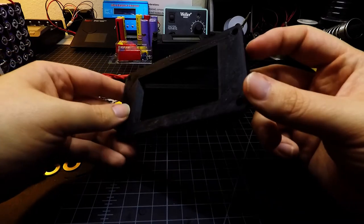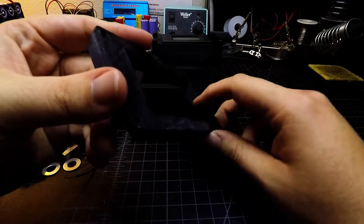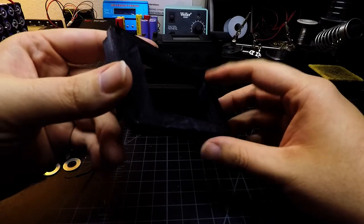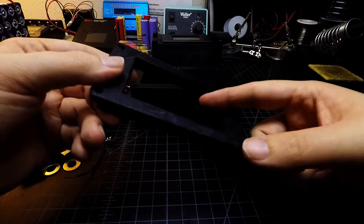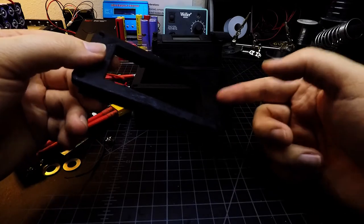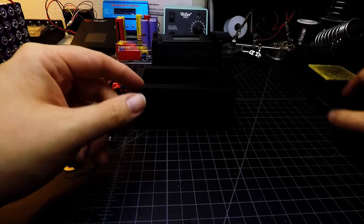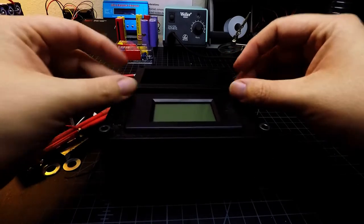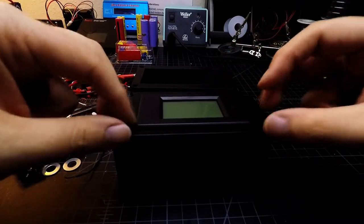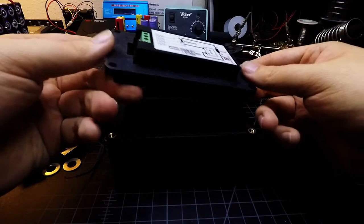While I had this first part I noticed there are wire terminals on the side of the electronics box, and I realized that with this really thick border on the plate it was going to make it tricky to get the wires into those connections. So I went in and created a 45-degree chamfer going in about 5 millimeters into the depth and 5 millimeters across the face, creating a nice easy ramp for the wires. I then printed another one, and these are M4 by 25-millimeter screws — just what I had on hand.